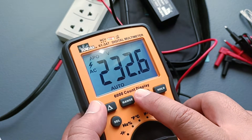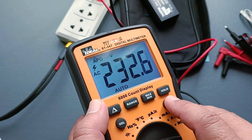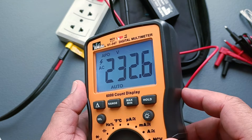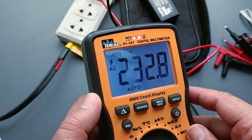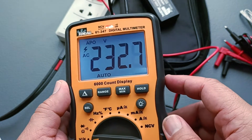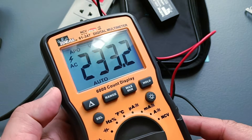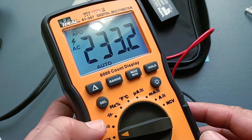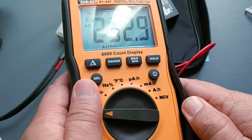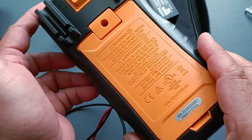The 6000-count display is big and bright, and the characters are bold, which improves visibility in dimly lit locations or under direct sunlight. Readability is good except when viewed from the top, which is the usual LCD response for most multimeters in this price range. The user's manual states it has a drop-proof rating from a height of 2 meters, and I believe the rubber cladding helps in that regard. It is removable, but there is no need to remove the rubber protection when changing the fuse or batteries.